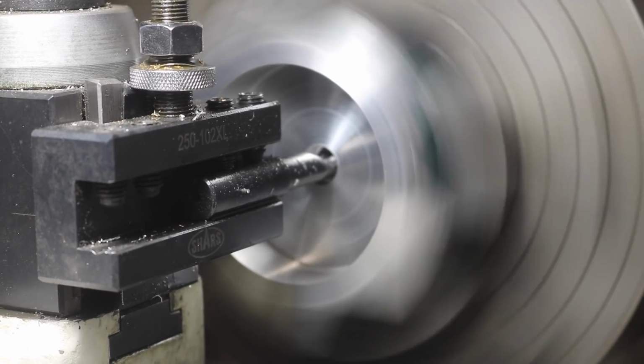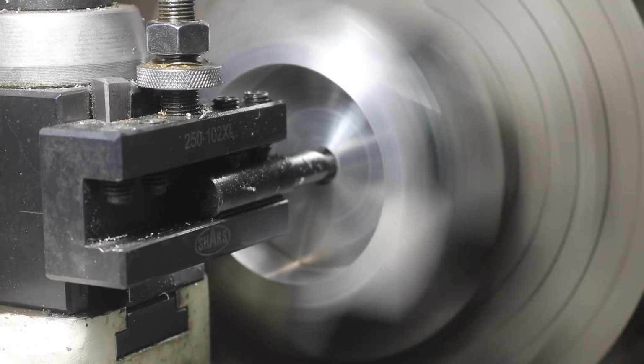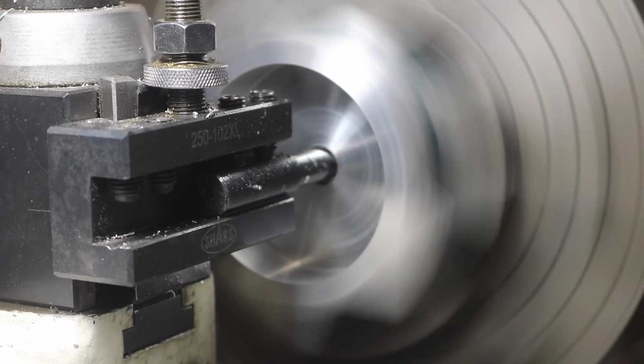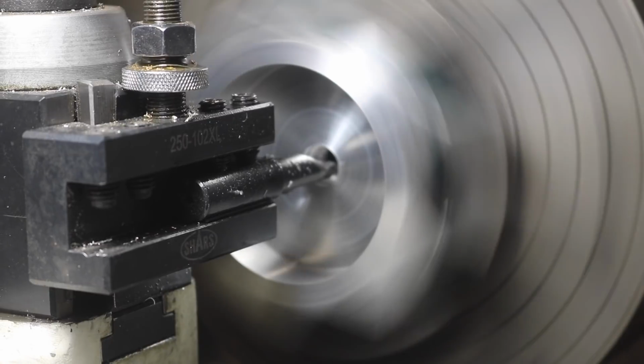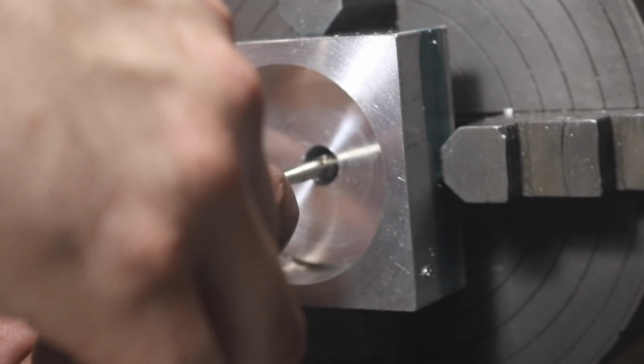After the cylinder bore is cut to size, I bore the hole out where the rod will pass. There are a number of ways to seal this hole around the rod, and I chose the simpler method of having two O-ring grooves, which I don't think I got on camera.